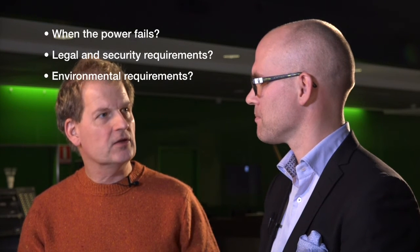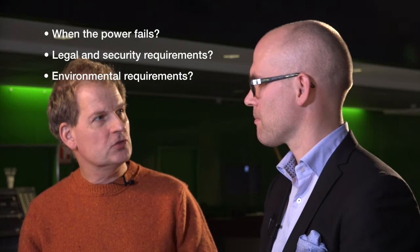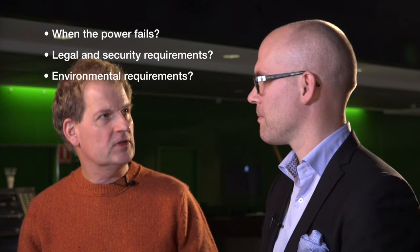That should be on the incoming connection. This is a lot of stuff. And from an electrical perspective, how do you ensure that it can withstand the temperature and humidity within the henhouse? My suggestion is that we put it on the outside of the henhouse, in a sealed box that can withstand high-pressure water and dust — an IP67 classification, which means you can submerge it in water for about 30 minutes and it should withstand that without leaking.